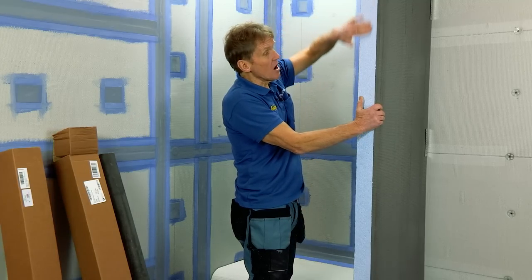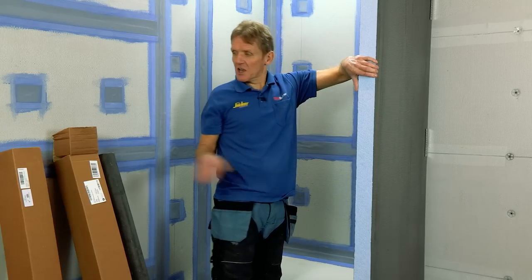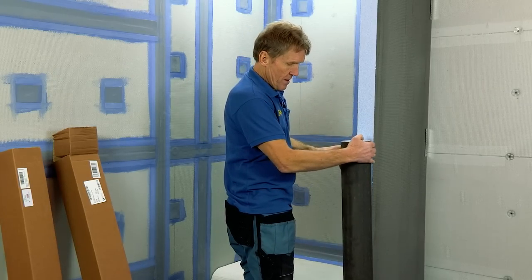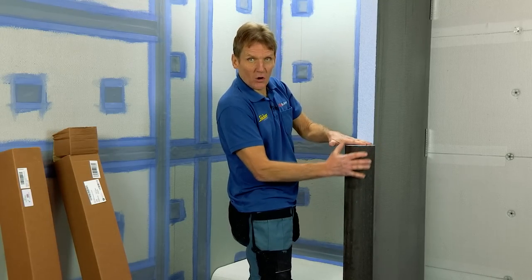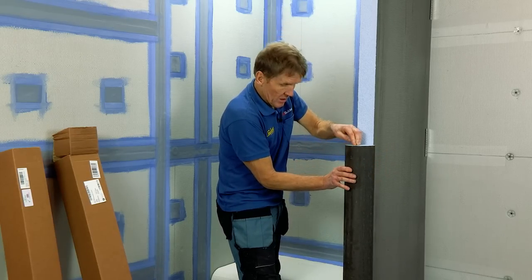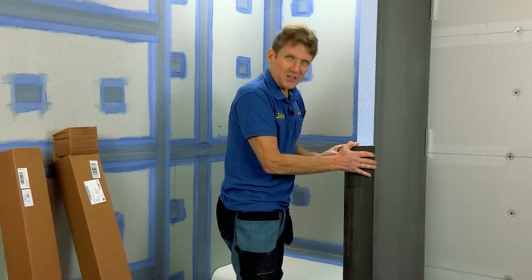And you can tile up around the edge here with a couple of trims on there, corner beads, but I prefer to use this end trim, which simply sticks onto the wall there to form this column, and then you can tile around that with the mosaic, and it really does make it an impressive looking feature.